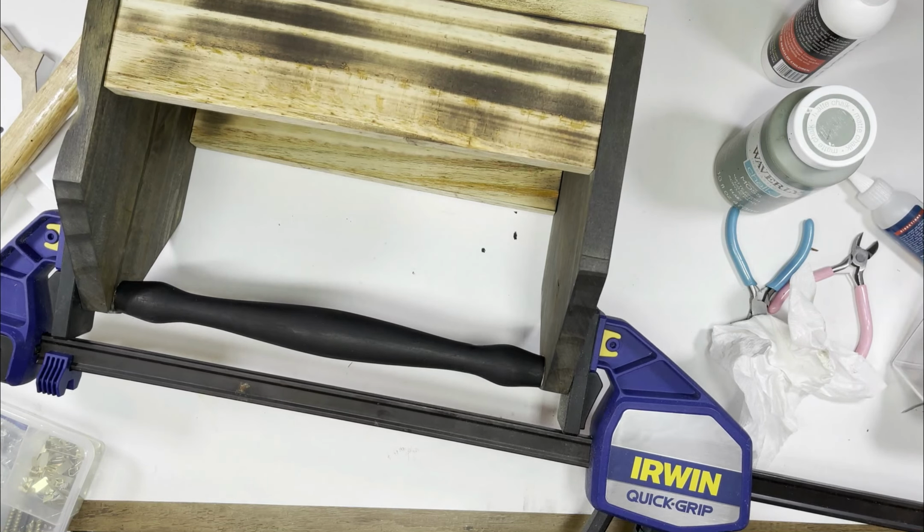All right, so once we're done with all the waxing, we're still not done with the waxing. I'm actually going to dim down some of the shininess from those nails because, look, this is rustic, it's farmhouse. No way these nails would be this shiny. So I take a little bit of paint, white or plaster or whatever, it doesn't matter what it is. And then I'm taking my antique wax and brushing on a little bit on top of that. The antique wax doesn't really like the metal, so you have to give it something to latch onto. Once you do that, it's got a little bit of a rusted look, so it's perfect. And here it is, all styled, and I cannot be more in love with it.